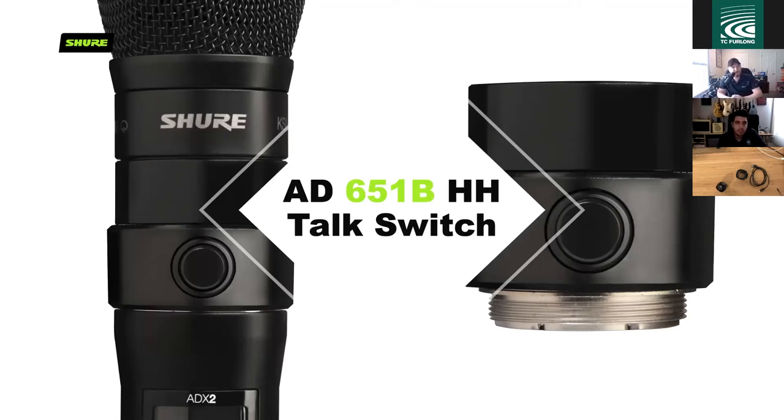So you can do a lot of things with this. You can create a band talkback for a frontman or a pastor at a house of worship to allow them to talk to the band or talk to their tech team. You can create an IFB with a corporate presenter, so they've got a back channel way to say, hey, my PowerPoint's frozen, because it's always video's problem. Any of those things that you want a secondary channel of communication to go somewhere else other than the PA, you can do that. We see this in sports reporters a lot. If they're talking to the truck or the front bench, they're spitting stats up or post interview questions and stuff, and that's not going to broadcast. So they're going to use a talk switch.